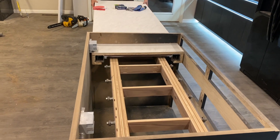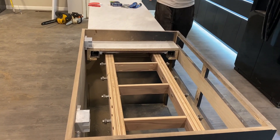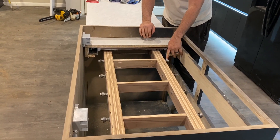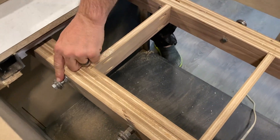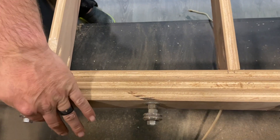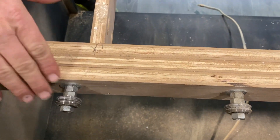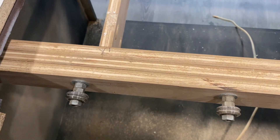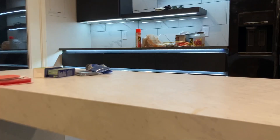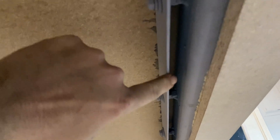I made these slides because I couldn't find a slide system I was happy with. I used V-groove bearings — I'll put a link in the description. I've used those before on my shop's Kreg table. I have a piece of eighth-inch flat steel underneath the table, and the V-groove bearing slides along it like train tracks. That's how the extension slides in — it just rolls right in on the V-groove bearing, creating a good sturdy slide.